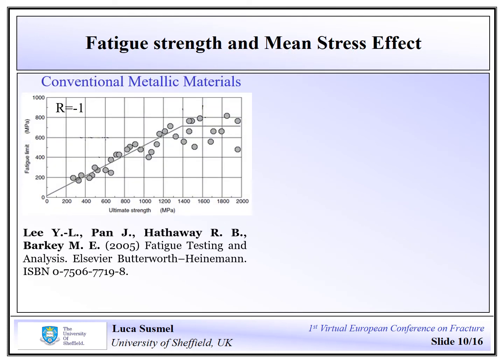In order to assess the overall fatigue behavior of the investigated material, initially it's interesting to consider this classic diagram which plots the endurance limit versus the ultimate tensile strength, where this diagram was built by considering a large number of different metallic materials, where these metallic materials were manufactured by using standard technological processes. And actually there is this kind of standard behavior where, up to around 1400 megapascal in terms of UTS, the ratio between the endurance limit and the UTS itself is equal to about 0.5.